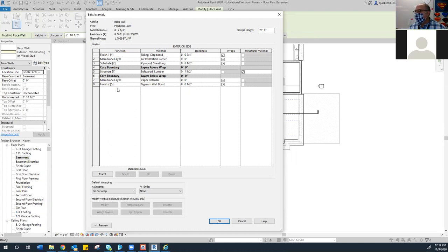Okay. And then the finished stuff goes away. So everything below the core, you can delete out. And that's going to bring us down to 2¾ inches if we're going to leave the siding on there. Okay? Because that's adding 3/4 inch and the sheathing on there. I really don't need both, but it's there. So we'll just go ahead and use that. I think it'll work. I will probably most likely change that siding out before this is done, but it's a start.